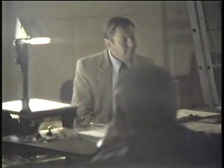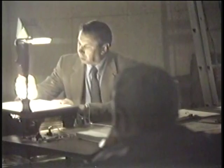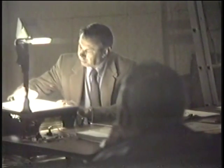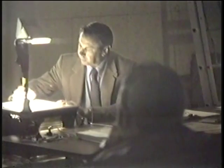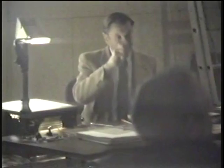Yeah, in the lower left-hand corner, left button at the bottom row, the record hold. If that's in the hold position, it just disables the stop button, no matter what function you're using. We've had a few of them coming in, people saying they don't work, and all you do is flip the switch and it's fine.